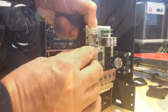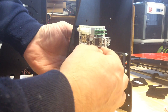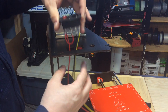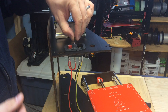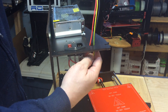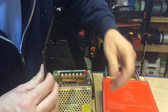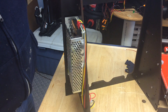The frame is screwed together with bolts and nuts. There were standoffs to hold the circuit board and a fan to blow across it, which is nice. The power supply was held in place with just three screws, then the on/off switch with a fuse — they did this well. A couple of screws held that in place, but the wires routed back out, which I don't like. These are line wires and they should have been protected more — some kind of sheathing. They really stretch to get up here, but I was able to get them to reach.